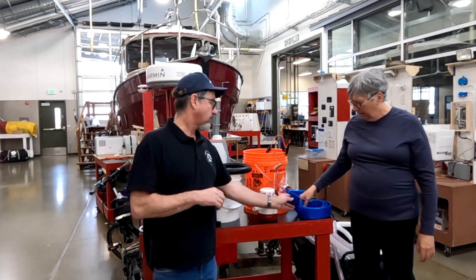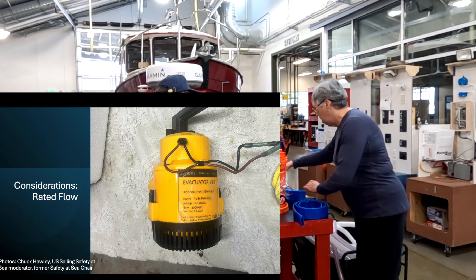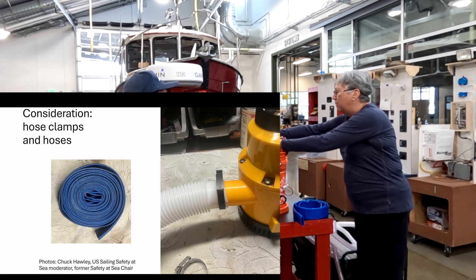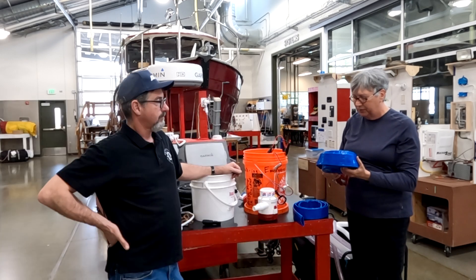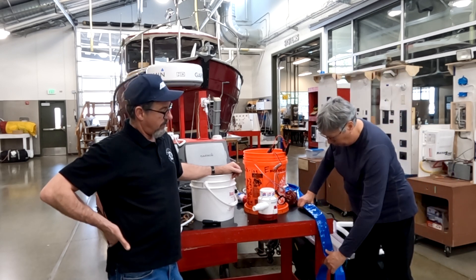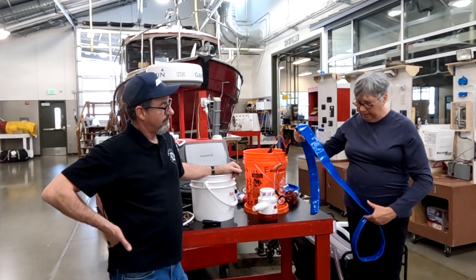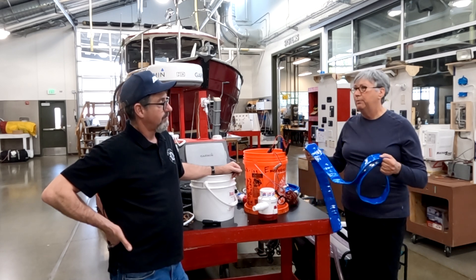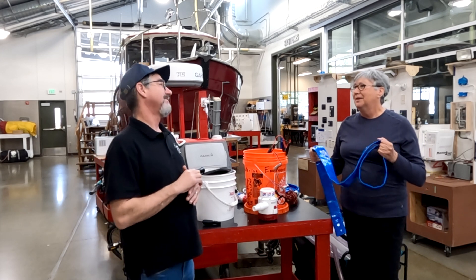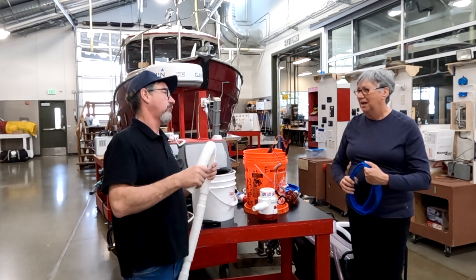Art's done a couple of these with a collapsible hose option — storage is the big consideration. The collapsible hose is a big winner in terms of weight and stowage. But the challenge is that it kinks very easily. If you get a kink in it while trying to get water out, that's a problem — like a garden hose kink. If you're on a well-crewed offshore boat with 10 people and you can have two people whose only job is to make sure the hose doesn't kink, that may work. But if you're a cruising couple, I'm going to stick to a corrugated hose that won't kink.